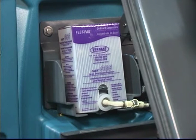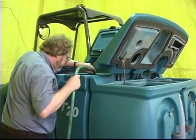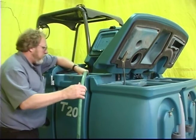After replacing an empty fast pack, scrub with the fast system for a few minutes to allow the cleaning agent to reach maximum foaming. Note: when the fast pack is not installed, plug the supply hose connector into the storage plug to prevent the hose from clogging. To prepare your machine for fast mode scrubbing after it has been used in conventional scrubbing mode, drain, rinse, and refill the solution tank with clear, cool water before scrubbing in fast mode.